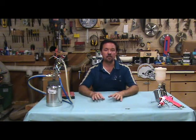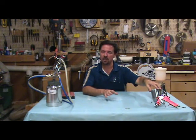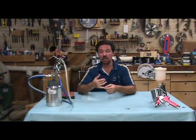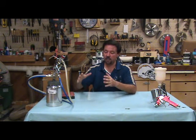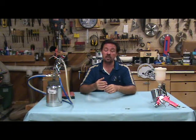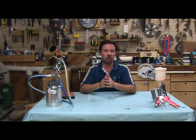Let's go over a couple of types of spray applications. You've got conventional HVLP style gun. Pretty much everything has to be HVLP today. So you've got your HVLP style guns, you've got your cap spray guns, or that's a generic name, your turbine fed guns, working off a turbine, flowing air through. There's a ton of different models of those out there. You've got your airless spray systems, excellent for production, lots of volume, some downsides to it, and your air-assisted airless, the Cadillac of them all.